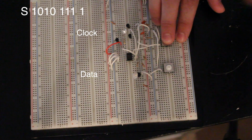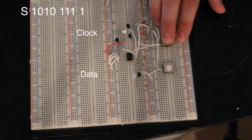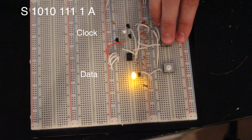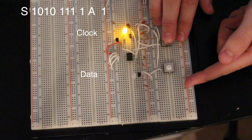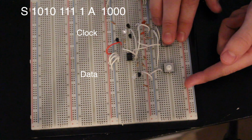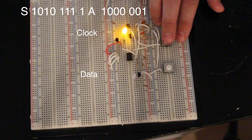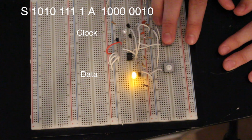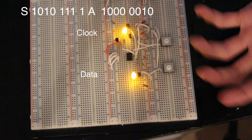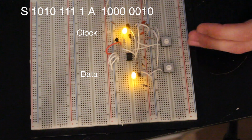It's a byte read. So the next 8 cycles are going to be the data information that it's getting back. Okay? So I think I wrote a 1 to byte address 1. There it is, the 1. So that's if we're just going to go down 1, 2, 3, 4, 5, 6, 7, 8, and then the acknowledge, and we're done. So now we're out. Okay? So that's what we just read. We just read that byte of information from that memory address. So that's pretty much it.